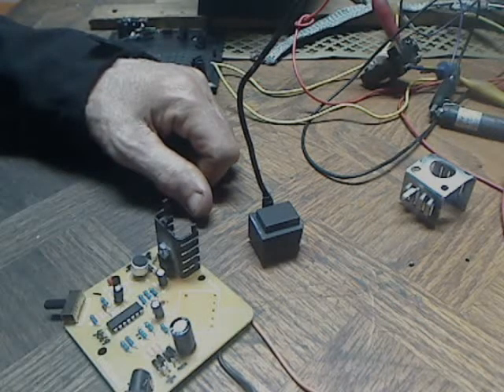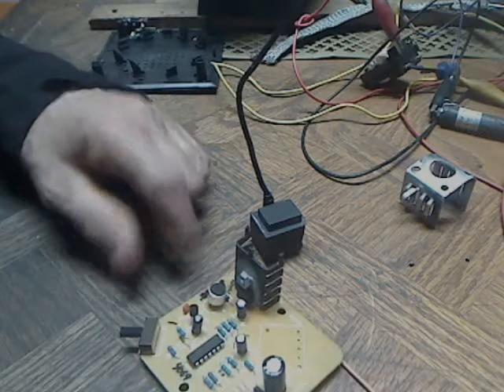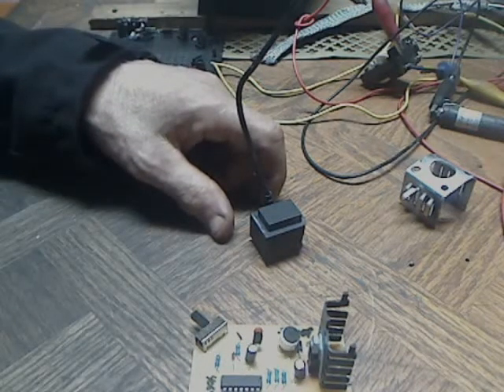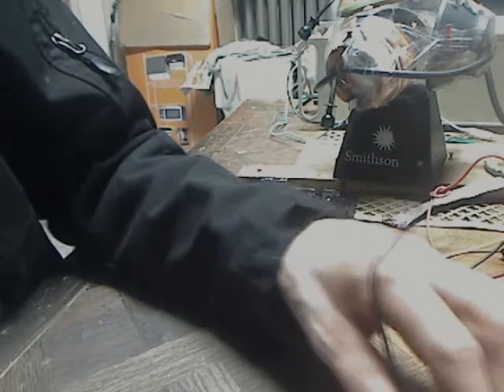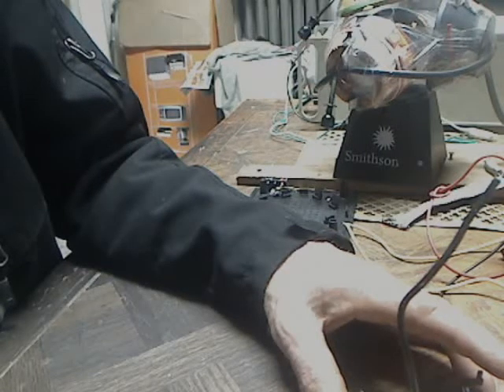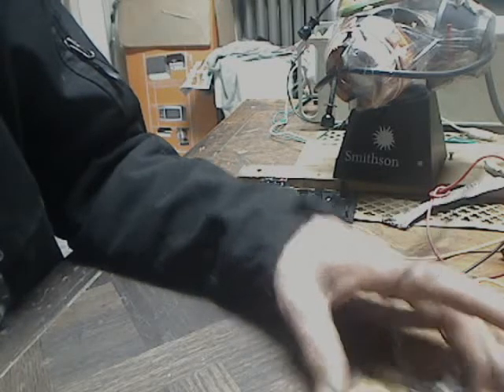So I'm going to have to get another globe and take the board out, put it in, and replace this with it. I've got a plasma tower — I tried replacing it with a different setup, a bigger transformer. It's not tuned to the right frequency. This globe — whatever gas they have in there — it's a tuned system. If you vary out of this frequency, the other one took more voltage and more current, and it would try to light up but it wasn't quite tuned to this closely tuned system. Everything works together.